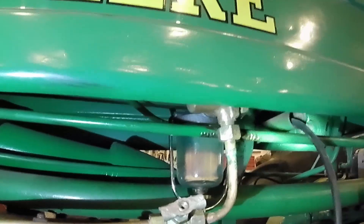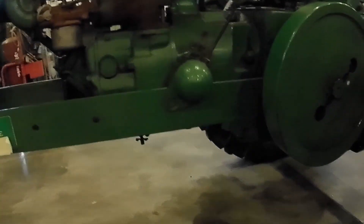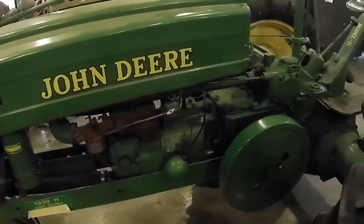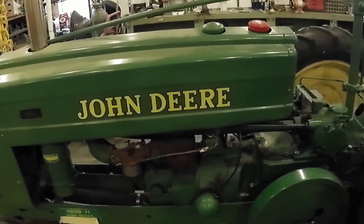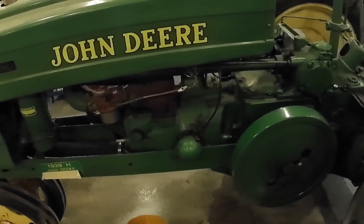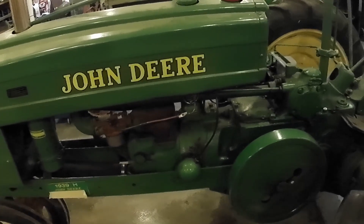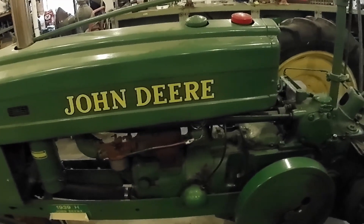You can easily see the line from the three-way valve to the carburetor. To make these tractors work on more than just gas, they had to do a couple of things to accommodate the all-fuel, tractor distillate, or kerosene. Those fuels burn a little cooler, so the engine kind of doesn't like to run on them as much as gasoline. Of course, now we just run gasoline — I've never seen anyone run distillate or kerosene.